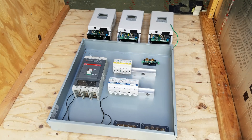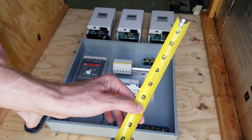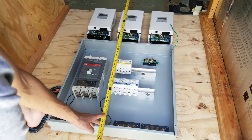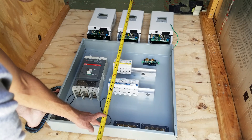It's finally time for the fun part — installing stuff. This is the way I'm going to lay it out. I have three charge controllers on top and they're about two and a half to three inches above the panel. When I put it on the wall I want to shoot for six inches of space between the top of the charge controller and the roof. That is unfortunately going to position the enclosure about 43 to 44 inches down the wall.